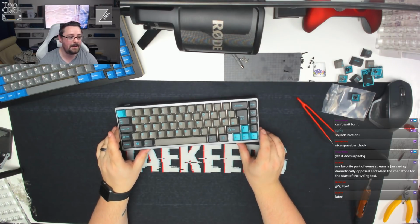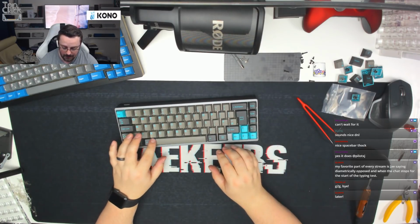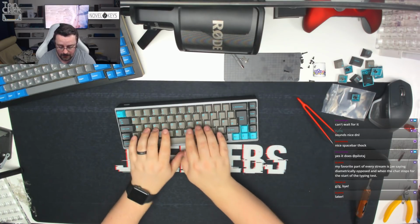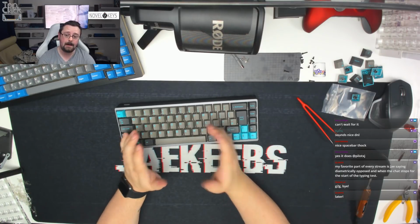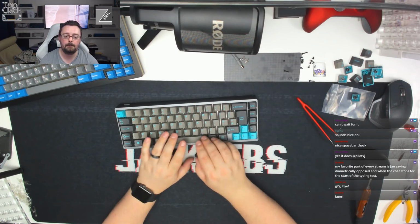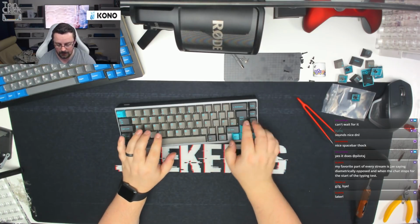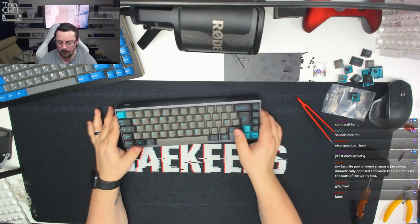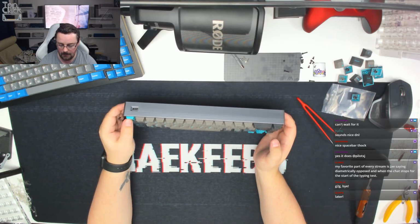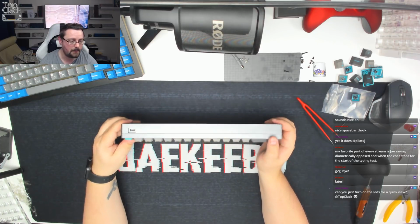There we go. So I think it looks really, really good. I think the board is stunning. I think it sounds great. It's very muted. The aluminium plate really accentuates the sound for a linear type switch. It's quite firm. There's very little flexibility to the board, which again I quite like. I know a lot of you prefer flexibility, but this one's quite firm with it being effectively a sandwich mount board. I will just have a tweak and play with the LED on this one off stream when I program it for DNL, and I'll just make sure that the case is aligned correctly, because that escape key not returning is kind of frustrating for me, but it is definitely catching on the actual case itself. So I'll have a look at that. I should be able to fix it. I suspect it's just a tolerance issue on the side of the board.